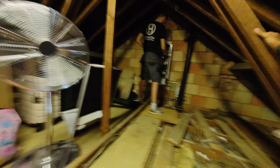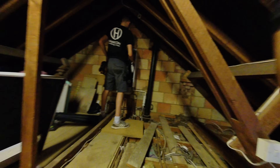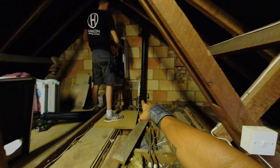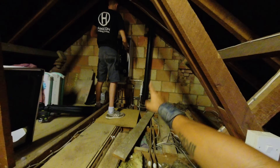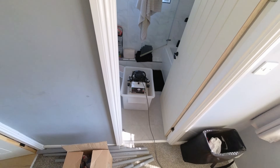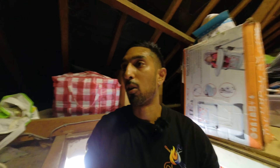It's going to be 28–29 degrees today — very hot up here. I've got a bit of light set up. The gas is already running in 22mm, which is great. Everything's there: lever valve on the cold already, so we haven't got to turn the water off to the whole property. Condense is running in too — that'll be sweet to latch on to. The power flush machine is currently heating up with the bathroom just here. By the time I get the boiler off the wall, we should be ready to start flushing, then get the new boiler on, pipe up the hot, cold and gas, and finish with the flow and returns.